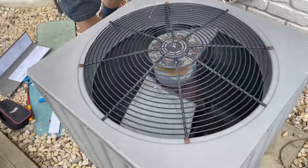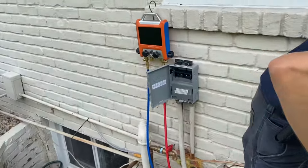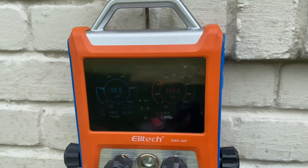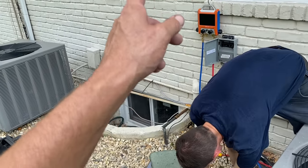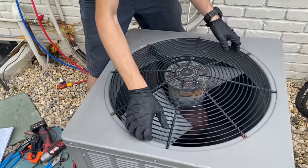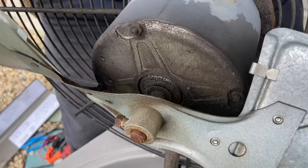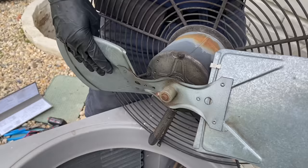Taking out these 5/16 screws — you can see the bottom of the coil there, it's pretty bad. Special shout out to Ellitech and the EMG 40V — I think it's pretty good. My only drawbacks are the long startup delay and the wired temperature clamps. And yes — we have plenty of oil there. She's shot. Let's take a look at the condenser fan and coil — it's seen better days, and it moves around.